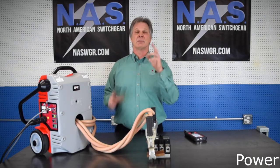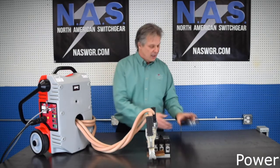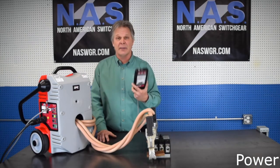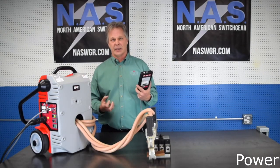The second factor is power. Right now I should be on 240 volt service. However, I look at my voltmeter built into the Raptor and it's only showing 217 volts, which is also pulling down the current that I can achieve in this particular case.